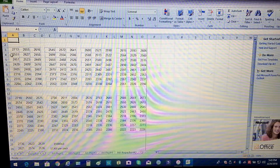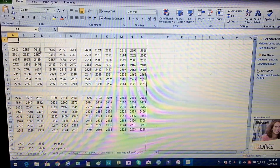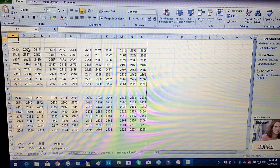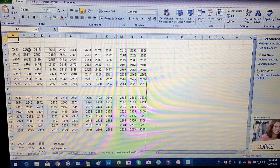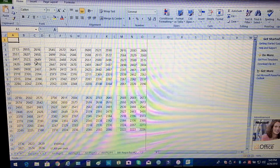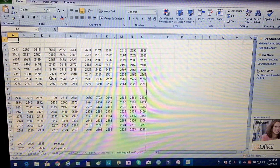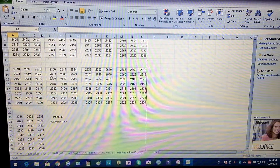After all that, I'd go back and get all my physical packs together. Because they're in some kind of order — the system pulls the highest capacity first and works down to the lowest — I laid out all my staged packs and would find cell numbers like 271, 3, and so forth. It's a very long process, but in the end they're all balanced almost perfectly.